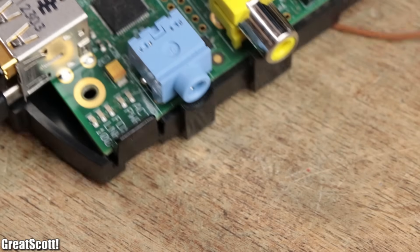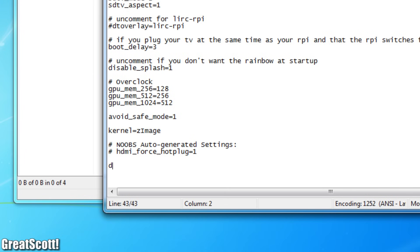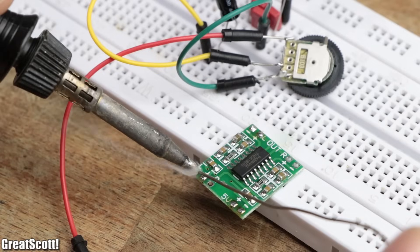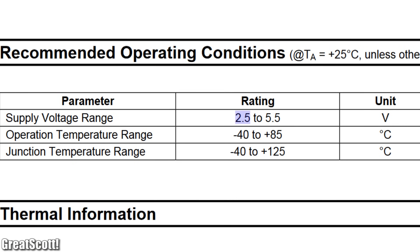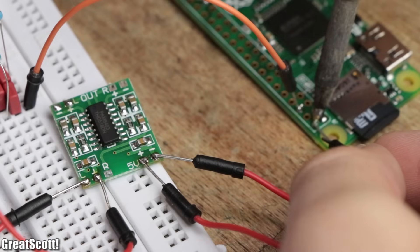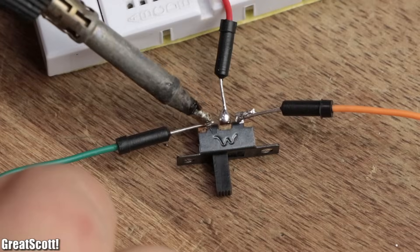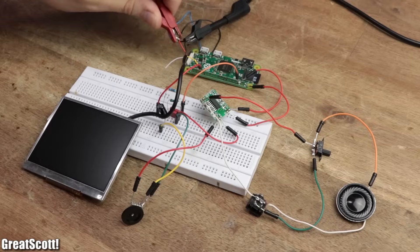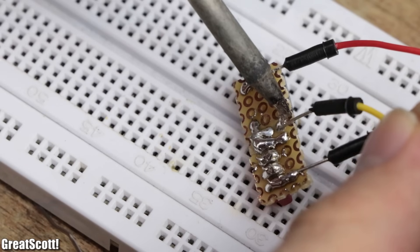Next is audio. The old Raspberry Pi B offered a 3.5mm jack, but the Zero type does not. Instead, we need to change the GPIO audio output pins in the configuration file, then connect pin 13 to an RC filter circuit, followed by a potentiometer wheel, and then to the PAM8403 audio amplifier. Since the IC works with voltages from 2.5V to an absolute maximum of 6V, we can simply connect it to the battery voltage. Its positive output goes to a slide switch connecting to a speaker and a 3.5mm jack for headphones, and the negative output to the other side of the speaker and jack. After powering up, the audio quality was acceptable, so I soldered the passive components to a perfboard and tested it again.